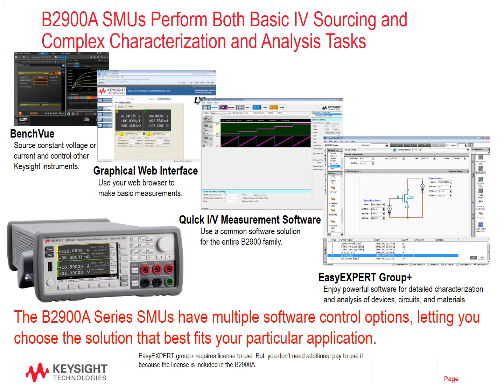Quick IV measurement software is a common software solution for the entire B2900 precision instrument family and supports up to 4 channels. It can sweep its output, calculate parameters, and show characteristics on an XY graph. Graphical Web Interface is one of the LXI functions and enables you to control the B2900A series through a web browser. BenchView supports the B2900A series as a power supply and enables you to source constant voltage or current while controlling other Keysight basic instruments. The B2900A series has multiple software control options, which help you choose the solution that best fits your particular application.